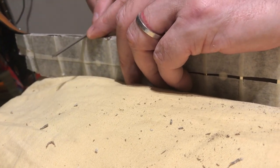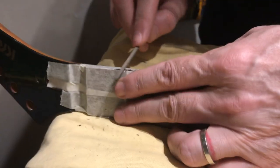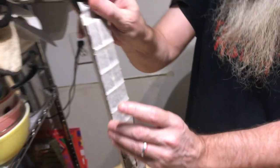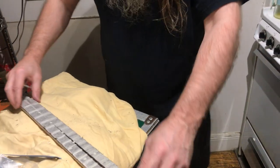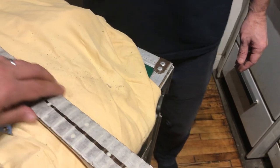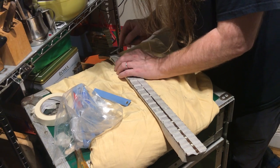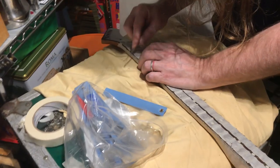Kind of just slide the file, see if it's sticking out or not. See if I still got any of that sprouting metal. The dreaded fret sprout. Can I run my hand down it to see? Yeah, you want to check to see if my hand gets sliced. There's going to be some little bits still sharp. Feels all right? Getting better? I'm just going to go back over it from this side now. It's getting there, isn't it?